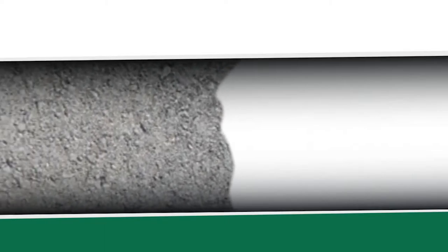The product I want to talk about is Slick Pack 2 — the best pump primer out there. Why do you want to prime a concrete pump? If you try to send concrete through a dry pump or dry pipe, you're going to form a plug. That leading edge is just going to lose moisture and plug up real quick. You need something that coats the pipe before you start the job. You could use a grout slurry, but then a guy has to carry a 94-pound bag of cement, or you'd be calling the ready mix for a yard of grout — they don't want to bring out just a yard to prime a pump. So why not have a handy half-pound small bag of Slick Pack 2 with you to prime before the job starts?